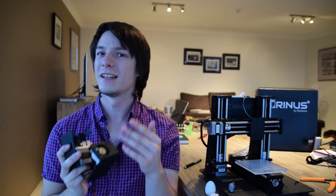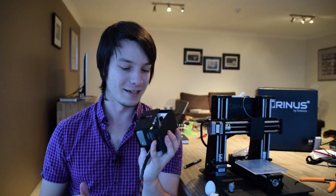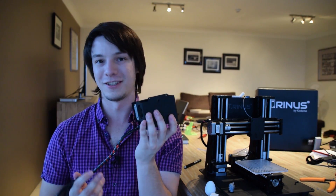Top marks to these guys for designing this extruder — it looks like a hybrid of various designs on the market but is definitely designed from scratch and improved upon. It doesn't look like they've just grabbed an E3D from a Chinese factory and slapped it in. My only complaint is that during printing, the fan duct doesn't appear to put much airflow onto the filament — I noticed a bit of drooping on the undersides of PLA prints. My advice to the Trinus guys would be to add more airflow for PLA prints, but also the ability to block it off when printing in ABS with the heated bed, since you'll still need to cool the stepper motor but won't want to cool the print bed or you'll get warping. All in all, amazing extruder design — super chunky, super well built, and it looks awesome.